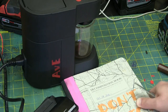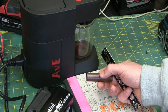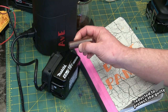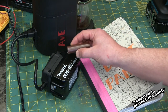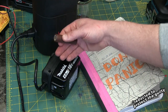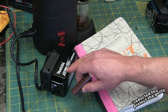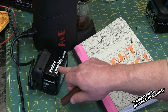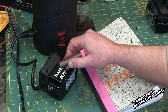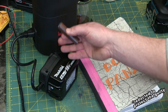Now before we get into the meat of it, we're gonna discuss lithium-ion batteries. There is a lot of confusion and frankly misinformation regarding what these can and cannot do. The problem is there are many many battery chemistries out there, even though they fit in this lithium-ion 18650 package and they all get branded the same. They are completely different chemistries and each chemistry is good at something different. For tool batteries we want relatively high discharge — maybe 15 amps — but we also want as many milliamp hours as possible. For a laptop battery you don't care about high current, only how long it lasts — how many milliamp hours between charges. Those are mutually exclusive, and I'm going to explain that.